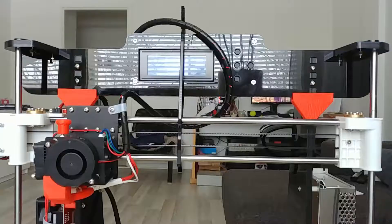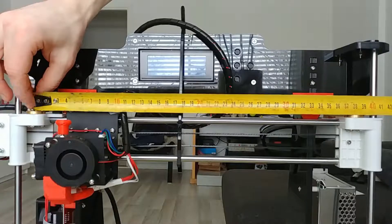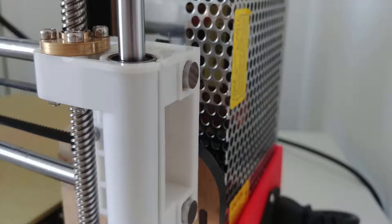Bear in mind that these distances should be equal. When I first installed the extruder carriage, I installed the guide rods flush with the edge of the mount. It turns out that on my printer, if the rods are flush, the distance between the brass lead screw nuts was too wide. The correct distance to match the coupler center hole distance was achieved when the guide rods are poking out of the mount just a little bit.